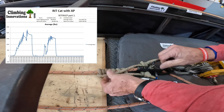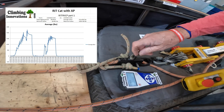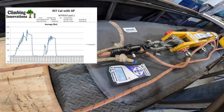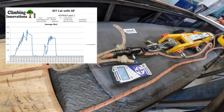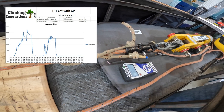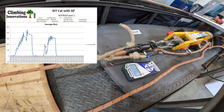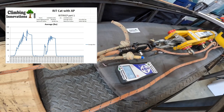I've broken the hitch back open and we will take the friction plug out and give it another pull. There's about 800 pounds — things are shifting a little bit. Now it's still tightening the hitch — there's 1,000 pounds, 1,200 pounds, 1,500 pounds — and it's locked on there now.